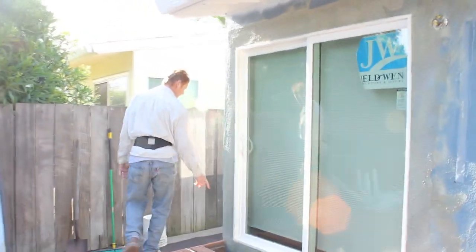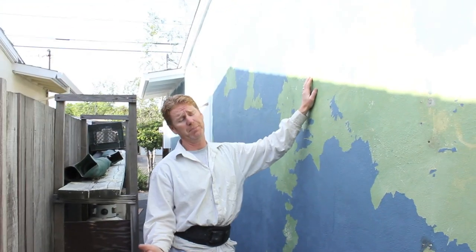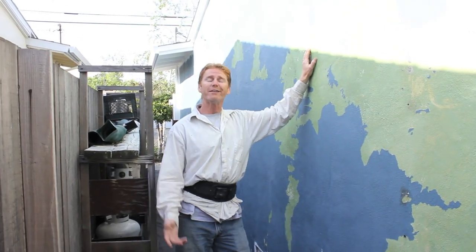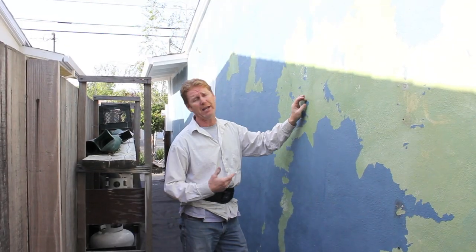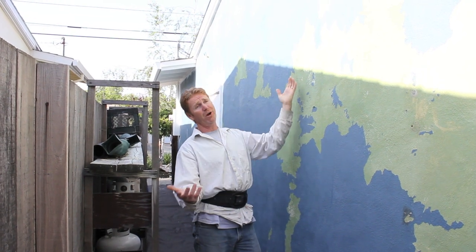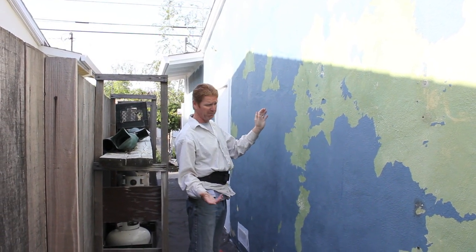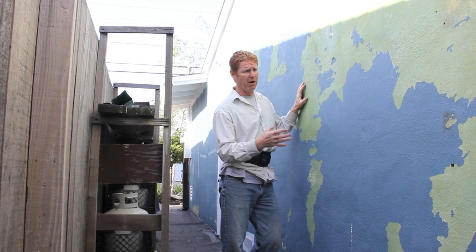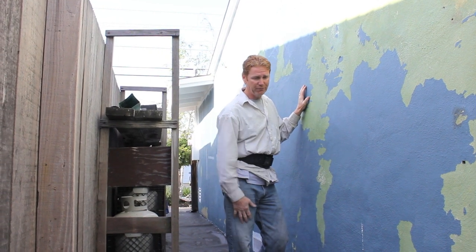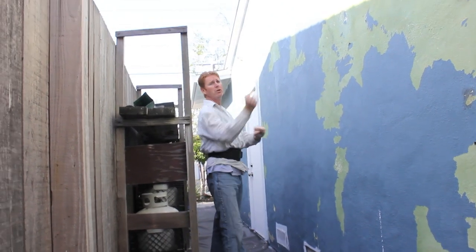We put a new sliding glass door in. The last thing I want to show you is this wall. I tell folks you can get a 1600 PSI electric pressure washer — I recommend a 2400. This guy got a 3100 PSI, which is pretty strong, and he removed a lot of the peeling paint. We don't know if there's lead in it, so I can't really do the pressure washing — for 200 bucks there's a $35,000 fine if there's lead in the paint, so we don't touch that stuff. However, he pressure washed as best he could. Yesterday we came and I used a putty knife and a trowel to remove a little bit more, because a lot of times when you pressure wash a house you'll remove 98%, but the next day as the water dries it'll still peel off here and there. What we're going to do now is put a new color coat finish over the entire thing — we'll show you that when we get to stage two.